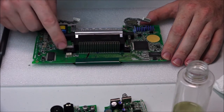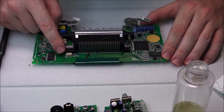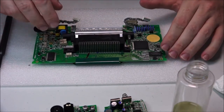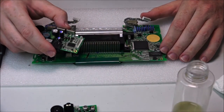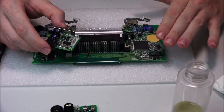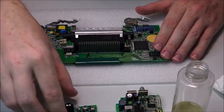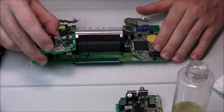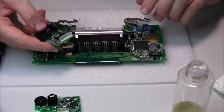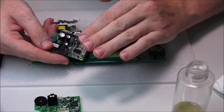We'll start removing some of these faulty capacitors, especially the ones which are wibbly wobbly and moving. And then once these are all changed on the board, we'll connect it back to the PCB, put some batteries in, and hopefully it will turn on and work. And if it does that, fantastic. Then we'll jump on to removing all the capacitors on the audio board, and then we'll replace the two here. Not the big one, because if we can salvage that, great.